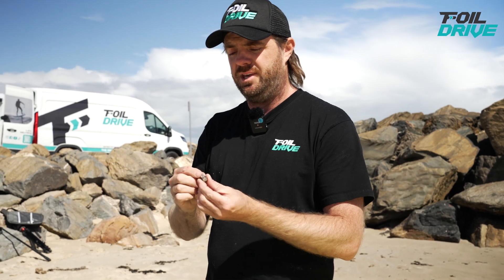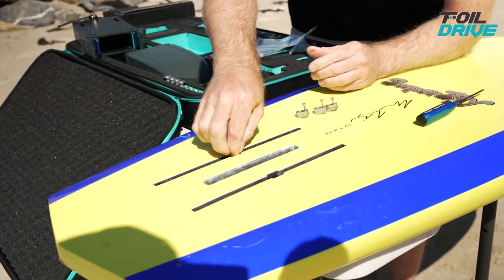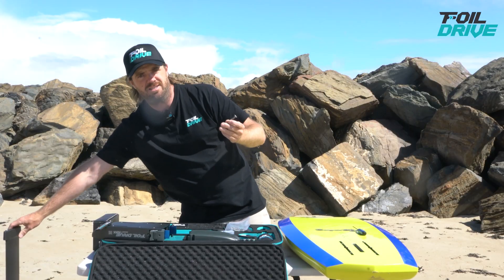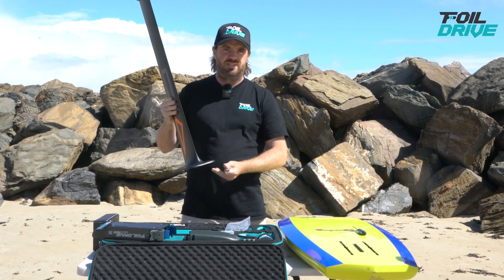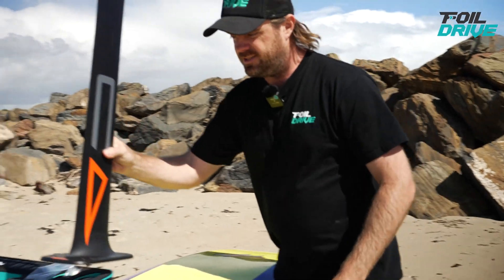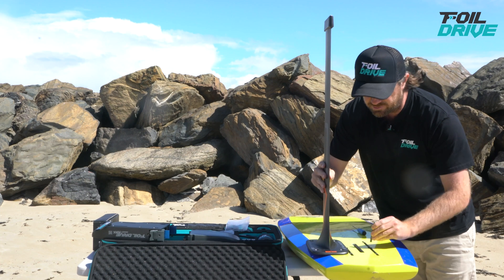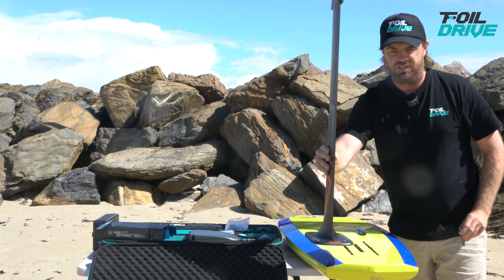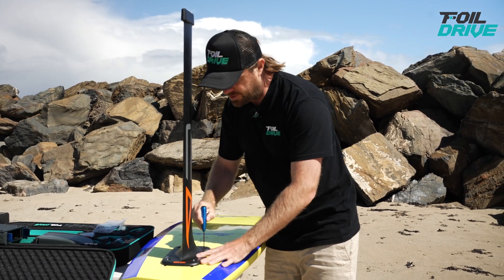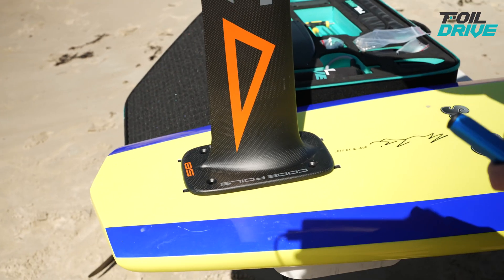To do that, I've put the bolts in and I'm going to put them in the tracks. If the T-nut's not moving, you might have screwed it too far down. I want to get my mast to give me the necessary spacing for the mast and the T-nuts on my board. I simply come over, put the mast next to the T-nuts and roughly line them up to the spacing and position I want on the board, then put the mast on top. I just want to make sure I can see the holes, poking the tool into the track.